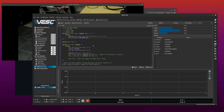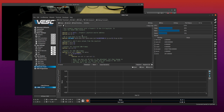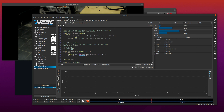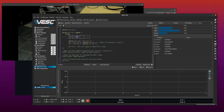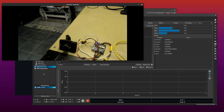We also construct the CAN ID according to the data sheet: we have a source address field where we use our own made-up ID, and we place it in the ID field according to the spec. That's why we go through one button at a time — the loop runs for one and a half seconds per button then moves on, and starts over when it reaches the last button.